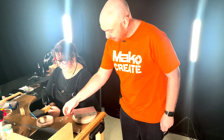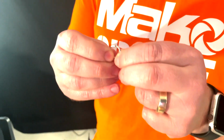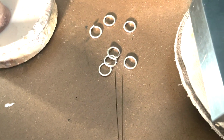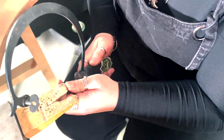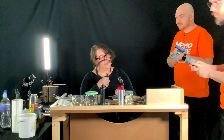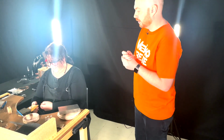I've got to say though, I'm pretty impressed with that. I think I'm all right with the sawing. I think you are. It's my go-to move. Not so much with the solder, but sawing, I reckon. I think you nailed your solder joint as well. That was perfectly fine. You've just got to be really watching to see when the solder flows. It's hard under these lights. You kind of need that darkness to see the temperature of the thing. But it's a flash. It's nice to watch.